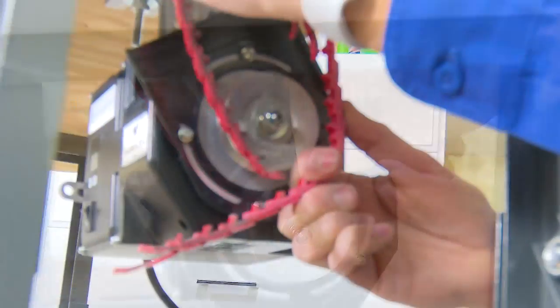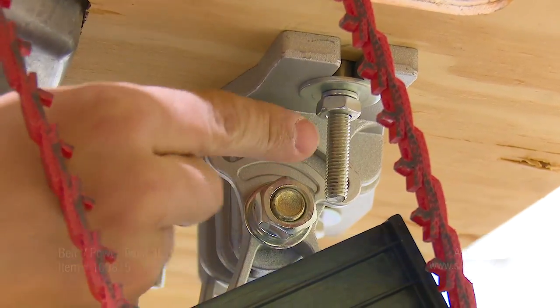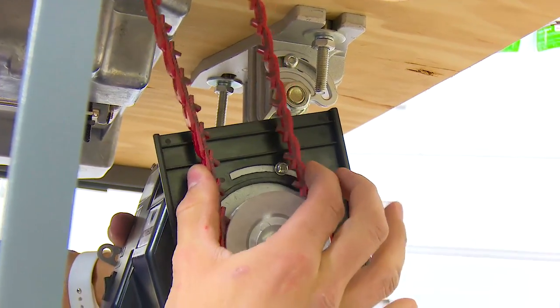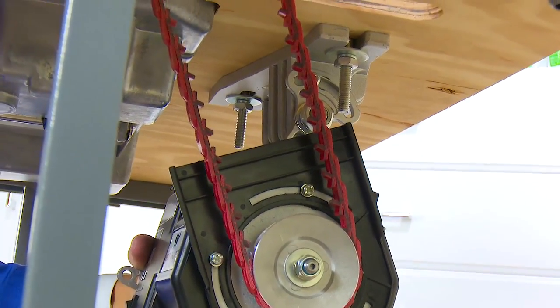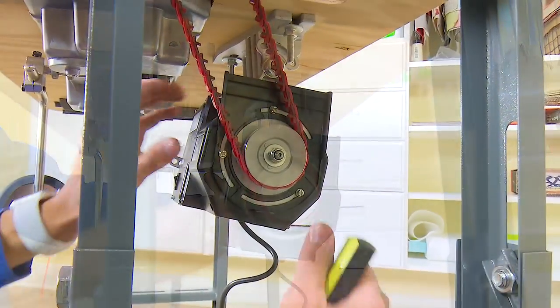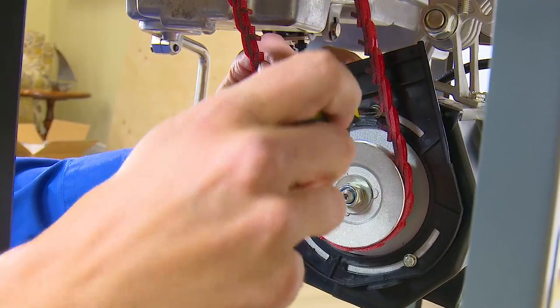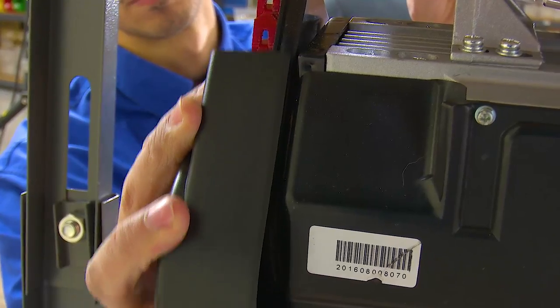Our V-belt is too short, but we're using the power twist belt and links can be added. Belt tension can be adjusted via this screw — the motor can be adjusted forward or backwards to get perfect belt tension. Once good belt tension is achieved, tighten the set screw. Now the belt cover can be adjusted so that it aligns with the belt and the three set screws tightened. Slide the belt cover onto the belt cover bracket, being sure the belt does not touch the belt cover.